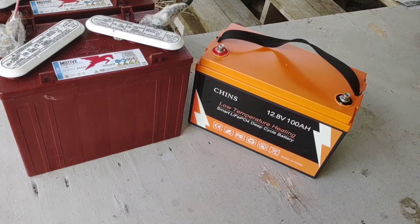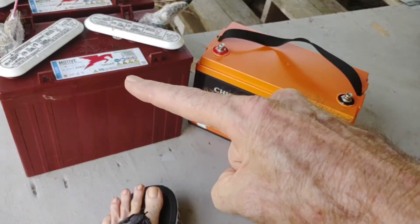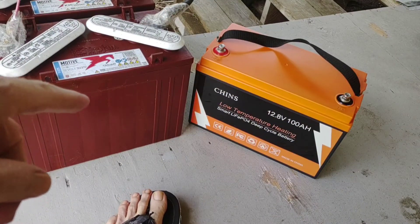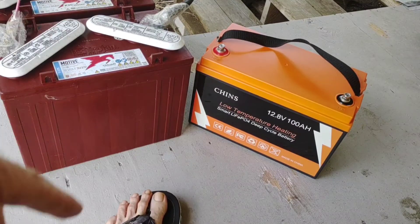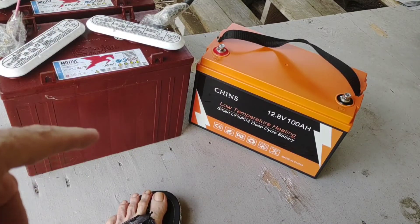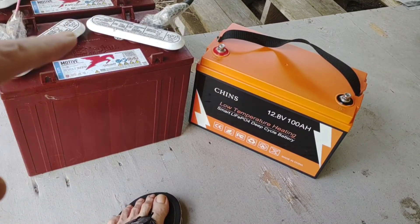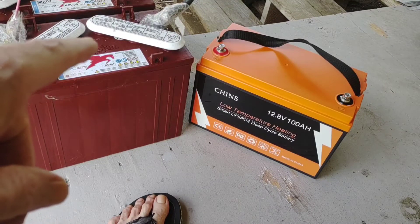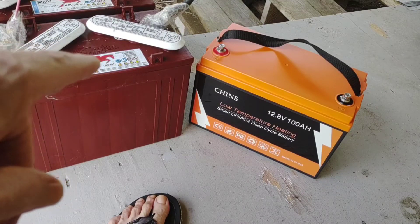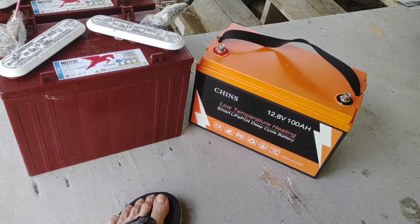The other great factor is maintenance. You've got to check the water on the lead acid — if you ever let a cell run dry you'll ruin everything. I know a lot of people procrastinate on that. I made sure to check them once a month like clockwork and they do use a fair bit of water. There's no maintenance on the lithium, so that was my third reason.